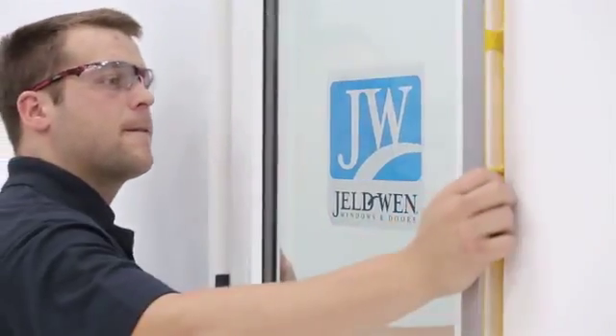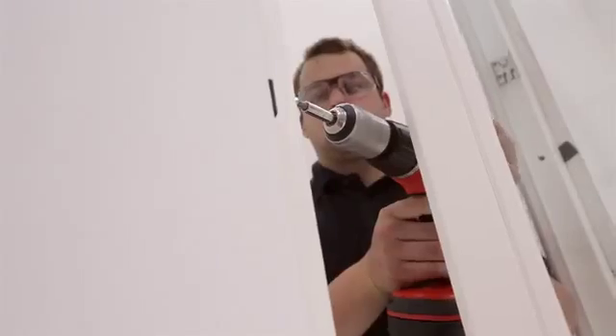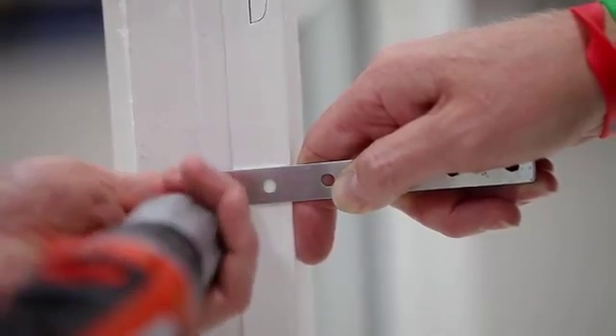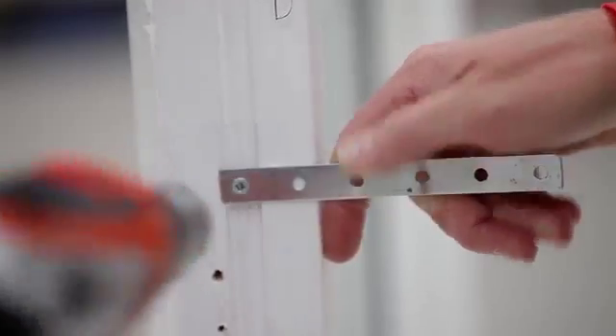Now we've packed it, you're potentially changing the shape a little bit, aren't we? Yeah, once you've packed it out you must check if it's level, plumb and square all around, and check that the window is actually opening and closing without catching — keep checking every time you make adjustments. Now can we go into securing the frame? Obviously this is a timber demonstration; you'd be doing it into masonry, so you'd need a masonry drill and bit. The preferred method is to use a fixing strap — that goes on your window frame, past your cavity onto your internal blockwork. Same again, no more than 150mm from the jams and no more than 450mm apart. Once you've done that, keep checking it's opening and closing, level, plumb and square.